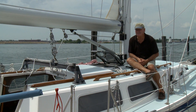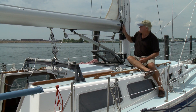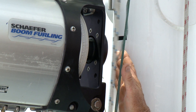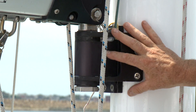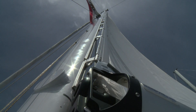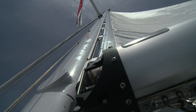One of the other key decisions in our design process was to locate the drum unit that drives the mandrel and rolls up the sail at the aft end of the boom. That allowed us to bring the sail as close to the mast as possible, and it also simplified the location and the assembly of the gooseneck. In addition, this clearance on this assembly allows the boom to go 180 degrees from port to starboard and still operate reefing or furling the sail.